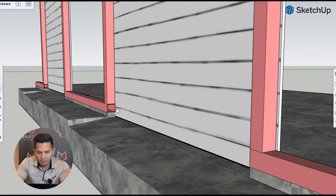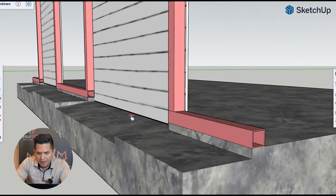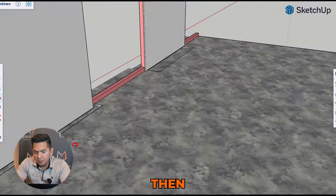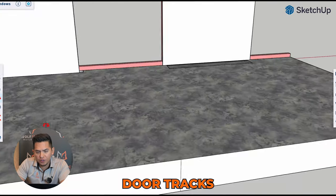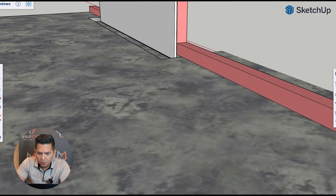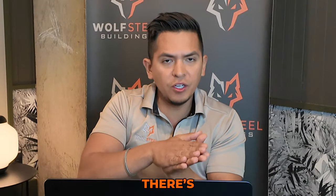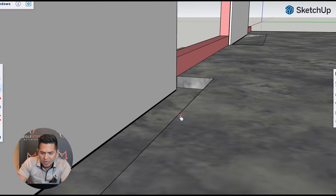In our case, we handle that. Same concept — we've got the base rail, the upright, and the door. But here you can see that the concrete was done so that the base rail is still sitting on the finished floor elevation, but then we cut back and make a notch around so the door tracks are sitting at the bottom — basically a one and a half inch bottom notch. That makes the door sit at the bottom side, therefore sealing the bottom of the concrete and the door. All your doors, whether it's a roll-up door or an overhead door, have a rubber seal at the bottom part. So when there's pressure against the concrete, you seal that — no critters can come in, no water can really come in, because we've got that barrier, that notch. It has done a great job.